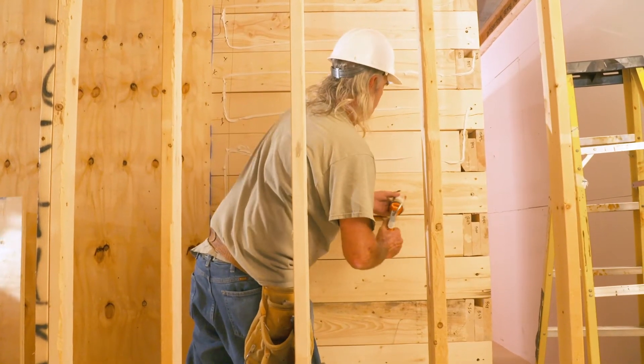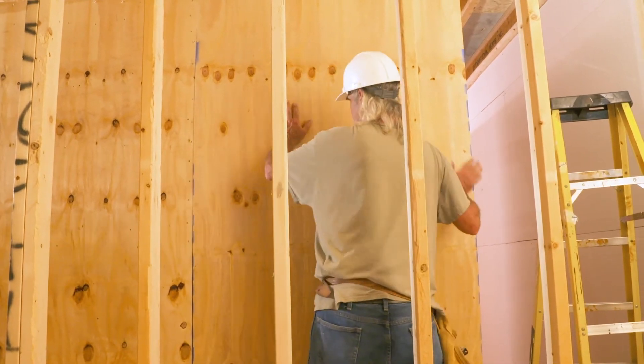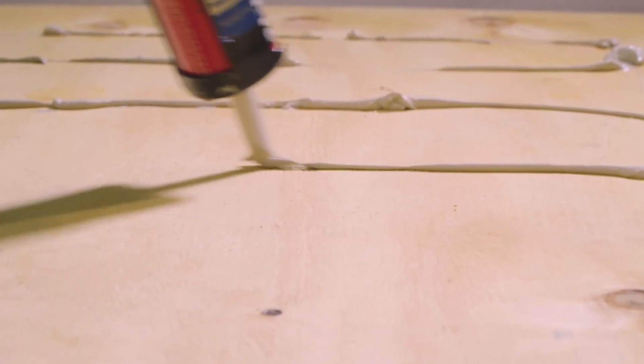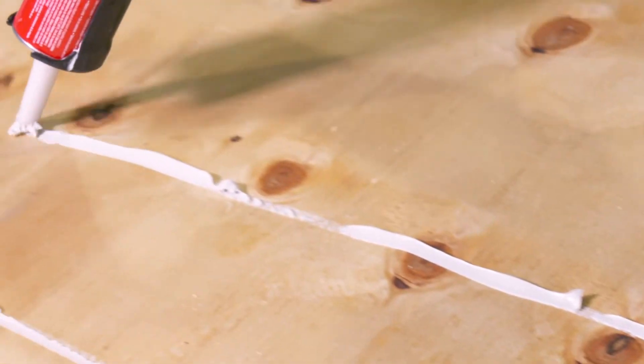The sheets that will cover the door wall must also include a cutout for the entrance. Before nailing the plywood in place, construction adhesive is applied immediately before installing the plywood panels to assure good bonding. The adhesive is critical to making the plywood an integral part of the assembly. One bead of wood construction adhesive is applied in a serpentine pattern up the full height of the wall.